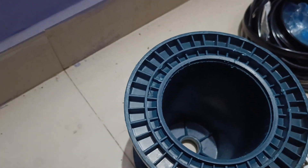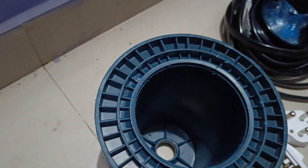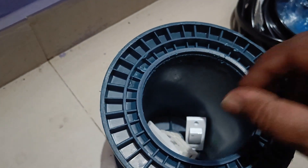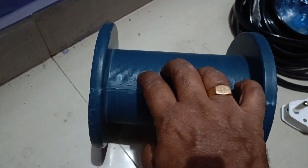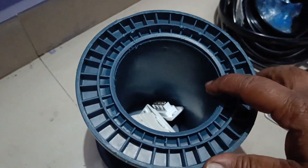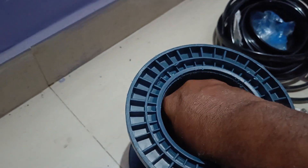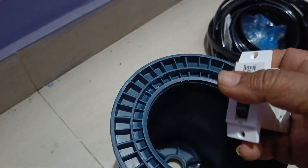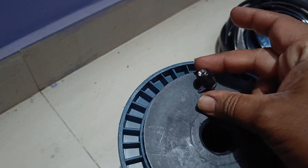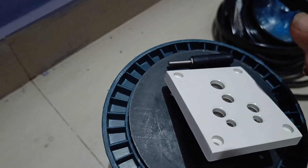The way I am planning the layout is the plug will be on the top piece. The MCB and the two-way switch should go inside, so I will be drilling some holes and controlling those switches from this back of the board itself — from the cylindrical place — so it will be safe and there won't be any external pressure applied to the switch tops which can damage these items. The banana clip should also come out here, and the plug will be here so I can pull everything from the top.